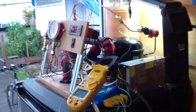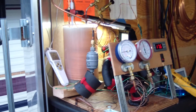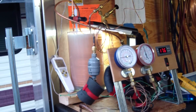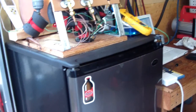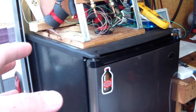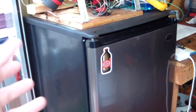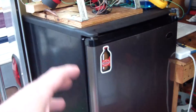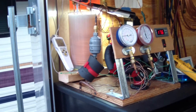Up until now I've been using a static condenser made out of copper — other videos cover that. I got this idea several years ago and a few days ago I decided to try it. I'm already storing cooling capacity in the fridge as a non-eutectic phase change material, so I'm pumping out four or five hours worth of absorbed heat and have to discharge all of it within an hour or two.